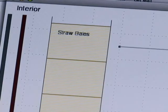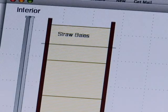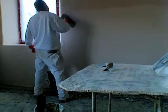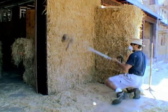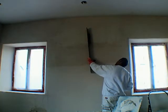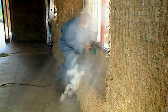Let's be really specific about how our straw bale walls are constructed and plastered. You can see by this cross-section how all the pieces go together. The straw bales are at the core of the wall. Then we have two-inch wire attached from the 2x6s on the floors to the beam above and secured through the wall to each other with ceiling suspension wire. We put on two layers of earthen plaster, each progressively planing out the irregular bales. Just as we put a layer of lime plaster on the outside, we will add a layer of gypsum plaster on the inside. These layers will be added to create a skin about 2 inches thick to protect the straw bales and add to the thermal qualities of the wall. Before applying the earthen plaster, we trim bales as necessary to get flat planes.